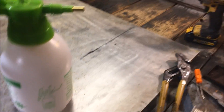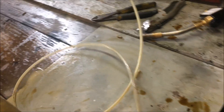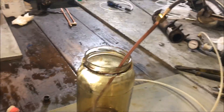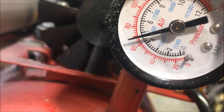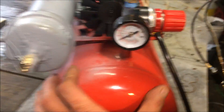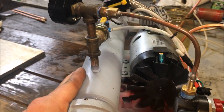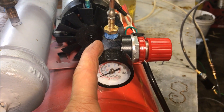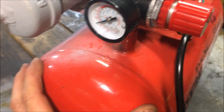So let's do a quick recap of what we just saw. Basically, I bought this five-dollar jug, chopped the end off of it, soldered it to a piece of pipe, and drilled the hole out to 3/32 inches. In the position we just saw, the nozzle is tightened all the way down to the finest mist possible. The reservoir oil tank pressure is at about 65 PSI. What we have here is a tank full of oil, and this right here is a pressure tank that the compressor is actually hooked up to.